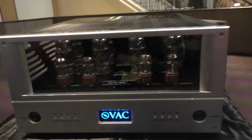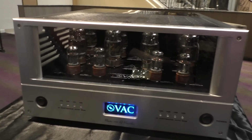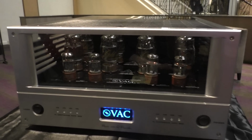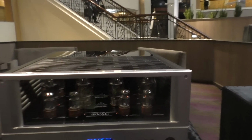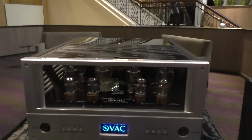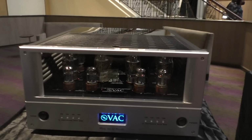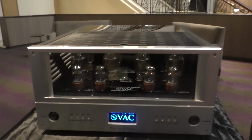This is derived from the Statement 452s that Mike, you know pretty well. Yes. It uses the same electronic assemblies, and obviously a simpler chassis, and with a different setup in terms of the magnetics. And it delivers either 160 watts per channel in stereo or about 320 in mono. It's natively a fully balanced amplifier, but does have conversions to allow a single input to come into it. So basically, it's very much like a Statement 452 that's maybe a dB less maximum output capable, and a little bit more than half the price, which makes it, I think, a really lovely amp.